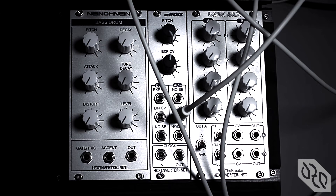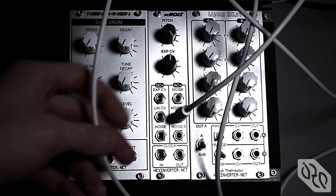It's a voltage controlled noise oscillator. You kind of have to treat this like a VCO, except for noise. It's not volts per octave, of course. But it does have an exponential voltage control input, which makes it a unique module in terms of noise modules.